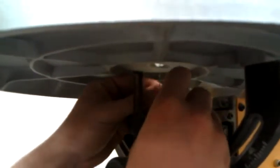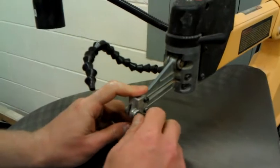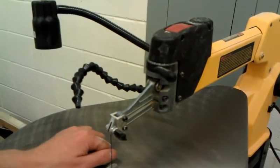Tighten the bottom, and then tighten the top. Make sure you're pushing down on this so it's all the way down. And then you tighten your tension — usually up to two, so it doesn't move very much.